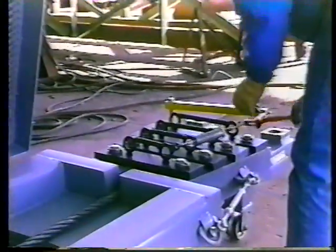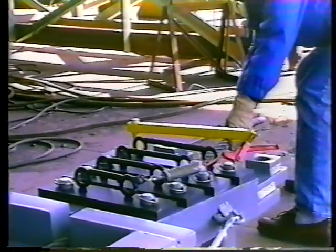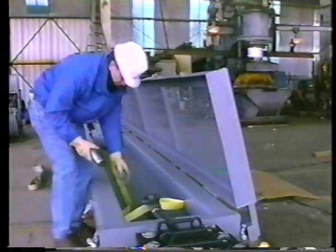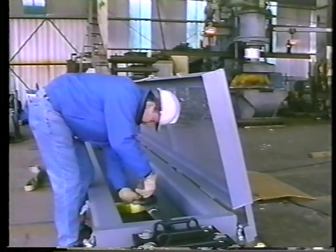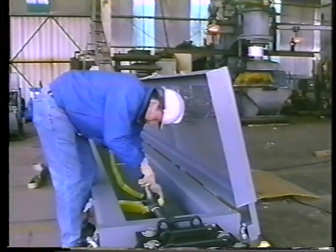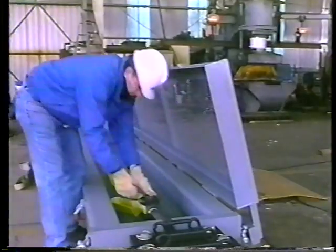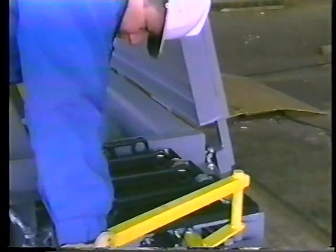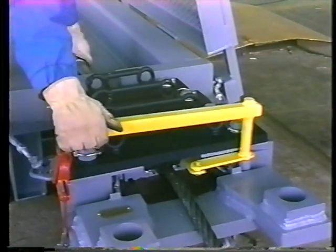As you can see, with a short sling to be tested, the open socket and wire is extended to the necessary length. To change the test machine to test a long sling is very simple: open the wire rope grip handles, pull the wire back to the proper position, and close the handle. Perform the test in the normal fashion.